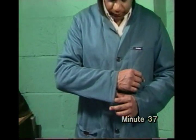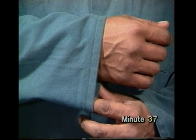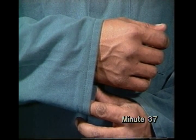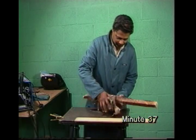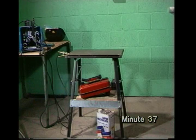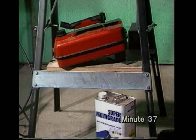Next, we want to draw your attention to some essential safety precautions. Make sure your clothing won't catch fire easily — close weave cotton fabrics are usually satisfactory, unless of course they're soaked in oil. Remove any flammable materials — that is, anything which can burn. Check anywhere that sparks could fall, and be particularly careful about flammable liquids such as petrol, oil, paints or solvents.